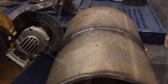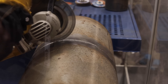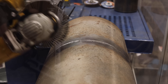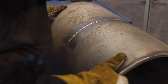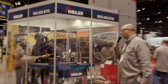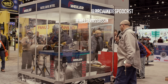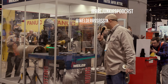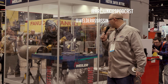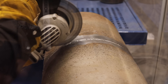It's done really quick. I've been on lines where they're doing 46-inch pipe — it's about a 30-second piece with workers on the other side. They want to ensure every part's clean, and they often pop out of the bevel a little bit. You don't want to pop out of the bevel with a grinding wheel and scar it or cause repairs. When doing a cap pass, it's quite often that you're coming outside that bevel and cleaning it up to make sure everything is ready for the next pass. So he's going to flip it over to get the feeling of flipping it — reducing that memory and self-sharpening.